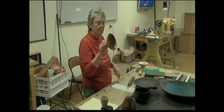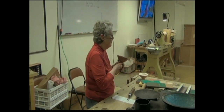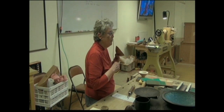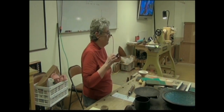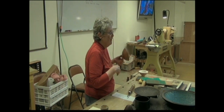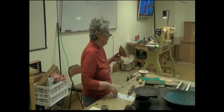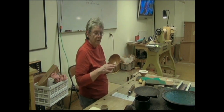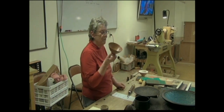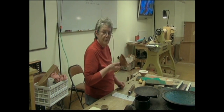It's Western maple, and I added fabric dye to it. Fabric dye is a fiber reactive; there are all different kinds of dyes. So Procion, and I don't know much about the new acid dyes, but people say they're really good for wood too. But I have a friend who makes clothing and used to dye her own fabric, and she said, well, wood is cellulose fiber. This dye is designed for cellulose fiber.